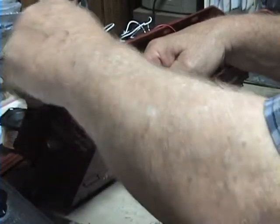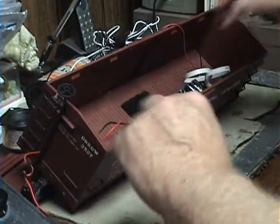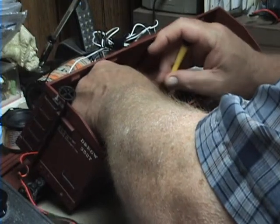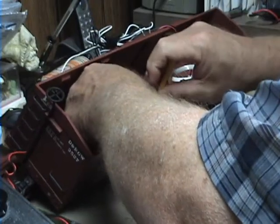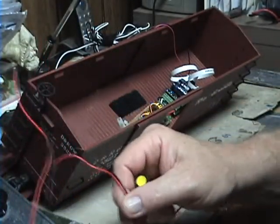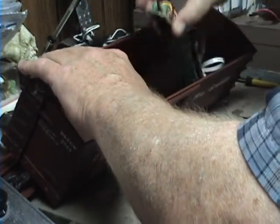And now I am taking the RCS, and we've got the MU plugs here, and we've got those wired in. So we will take a little screwdriver and take the black and the red wire out of there, so that we can pull that out through the little hole here. So there is our wiring setup, our MU setup with the MU plug on it, and just bare wires on the other end. We'll set that off to our left here, and now we can remove what I said previously.